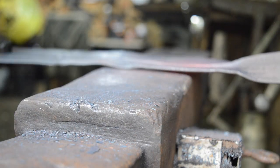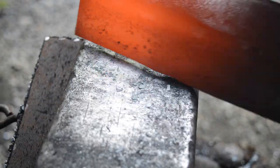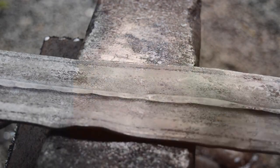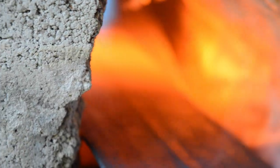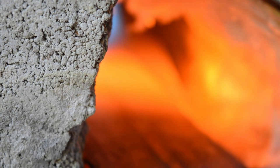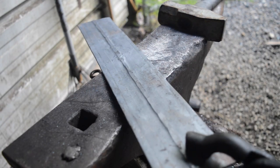Now how did I figure out that this was high carbon steel? Well it was completely by accident. I made a crucible out of this once, probably about a month ago, for smelting brass. And when I had the ingot, I plunged it into the water while it was still hot. When I pulled it out, I smacked the back of it to get the ingot out, but it broke my crucible and left a nice grain structure. That really surprised me, and I figured, if I've got this good of a grain structure, could I harden this to some degree? And the answer is yes. It's about 60 to 65 HRC, which is surprising.